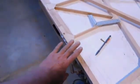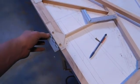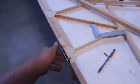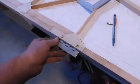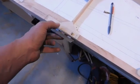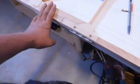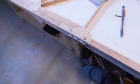So that's the hinges into the horizontal stabilizer. Now I'll move that up, attach the elevator onto there, mark and drill the rest of those hinges so that it's good to go when you do your final build - when you put them all together, they'll just fit right in there and the screws go right through. Still not sure whether I'm going to put them in here permanently and cover it, or cover it first and then put them in. Let me know what your thoughts are.